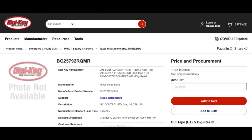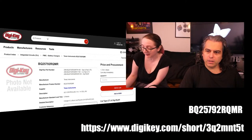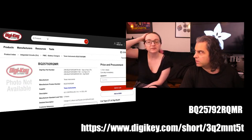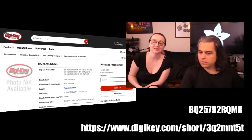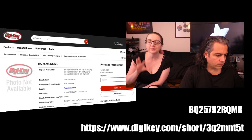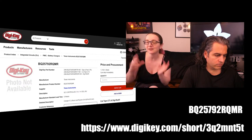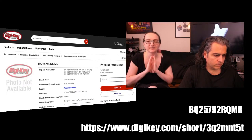Basically it's an all-in-one solution — if you've got a bunch of LiPo batteries, this charger will probably do the right job for you. It's a great chip and it's in stock. It's only a couple of bucks. The part number is BQ25792 — you can search for it. They have a couple thousand in stock and I'm definitely going to pick some up. It's available in QFN, it's non-BGA, not too many pads or connections — it's bare bones but very complete.